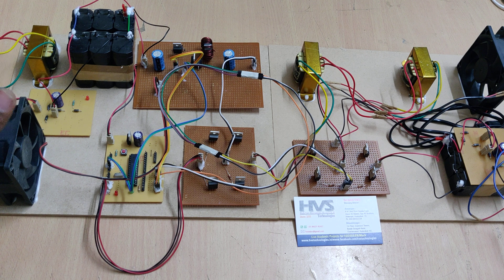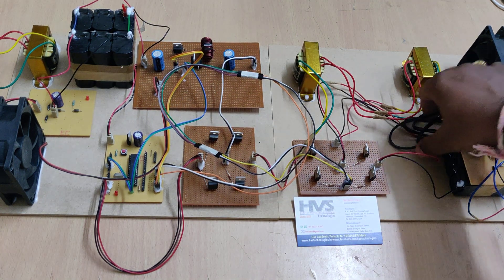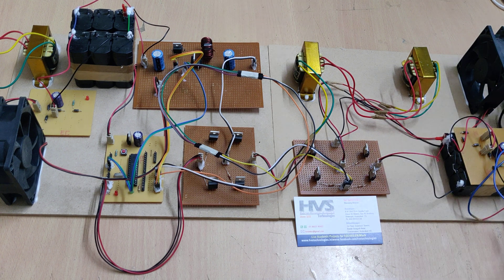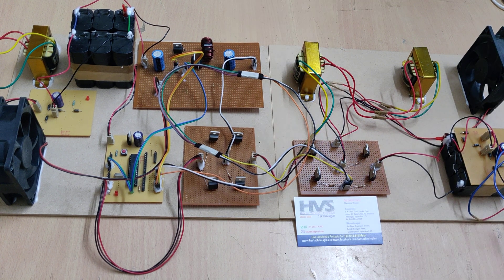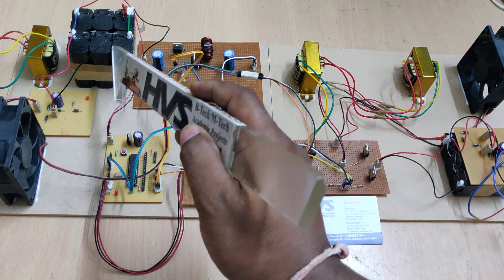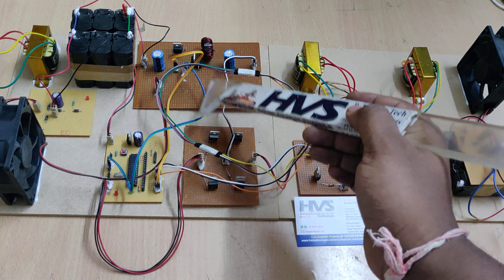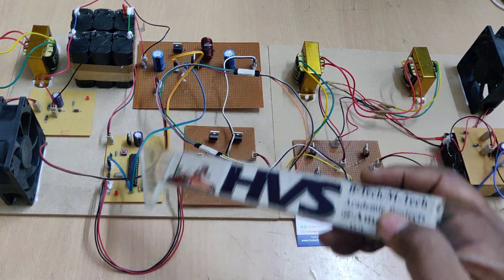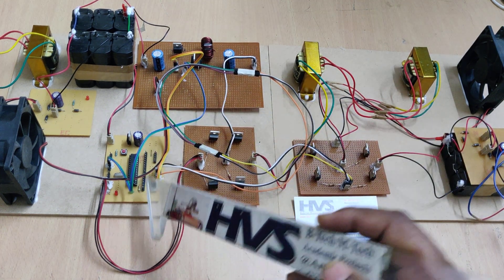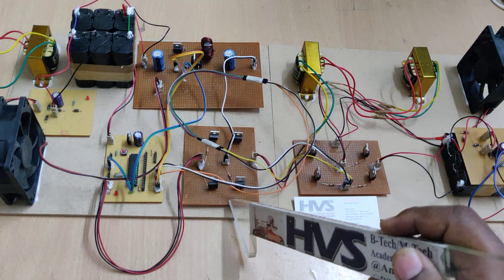This is a grid used only for charging this battery. At this end we are using a transformer along with a regular power supply board just to charge the battery. The main flow of the project is from the battery to this bi-directional buck-boost converter, which gets the pulse input from the microcontroller. The output of this bi-directional buck-boost converter is then fed to the H-bridge circuits.